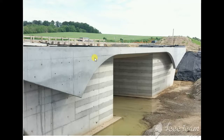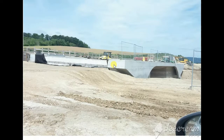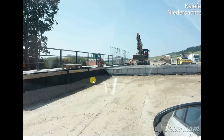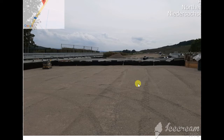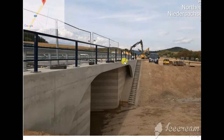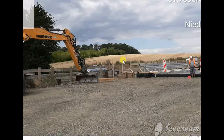Now it's totally complete. There is still waterproofing work above, backfilling from both sides, and the approach slab to the bridge. Now they make waterproofing work — called in Germany 'Abdichtung.' They are fixing the guard rail from both sides, and still doing the backfilling. They start with sub-base material and fix the handrail behind the guard rail. You see it is almost ready — they mix mortar and close the canal or duct.